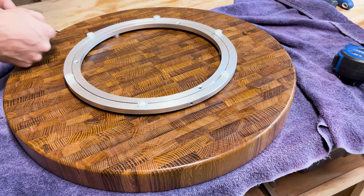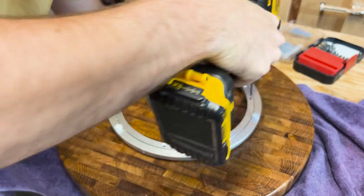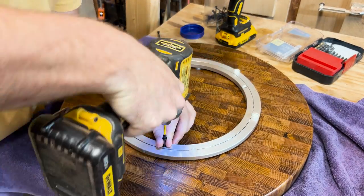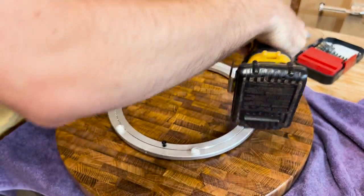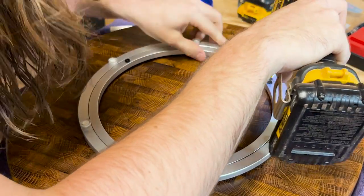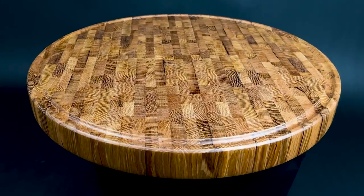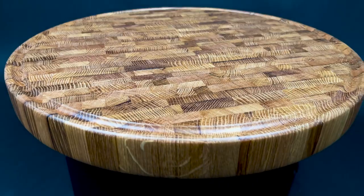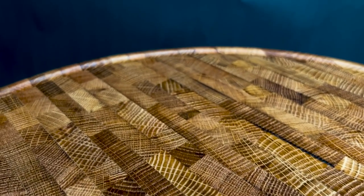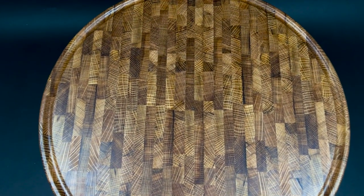Because this board was so massive and round, I thought it'd be cool to add a lazy susan ring so you can reach around and utilize all parts of the board. Because the ring is only 14 inches in diameter compared to the 20-inch board, you can have it overhang off your counter a little bit so you can be right over the top of it or scrape scraps off into the trash underneath. I made sure it was perfectly centered, getting it within one millimeter on all sides. The board ended up weighing 18 pounds, so it won't wobble over — you pretty much have to put your entire weight on the edge for it to tip. It can be used as a cutting board, a serving tray, or a centerpiece, and you can even take the lazy susan off and just have it be stationary. The end-grain look is super cool along with being able to see the charred and weathered parts. Even after the wax and mineral oil treatment, if you put your nose up to it you can still smell the Buffalo Trace, which is really cool. I even made a terrible infomercial about it if you want to check it out on my Instagram or a short I posted to YouTube.